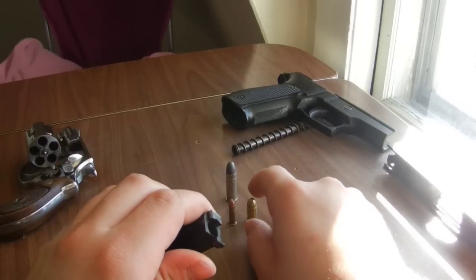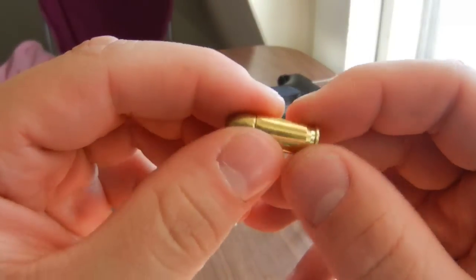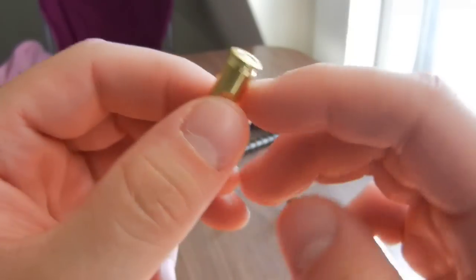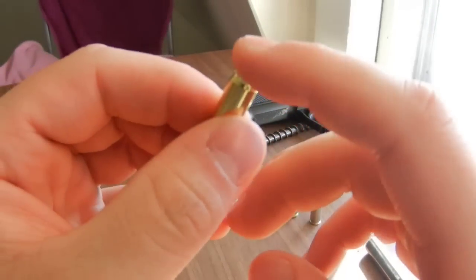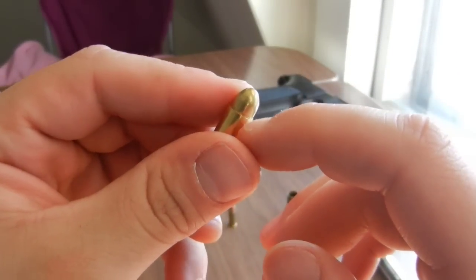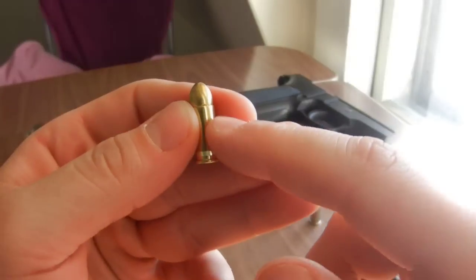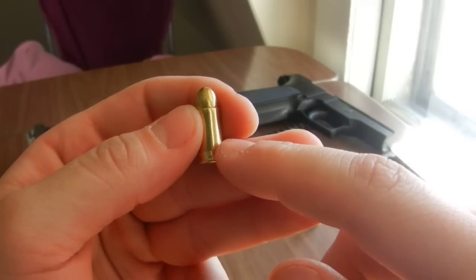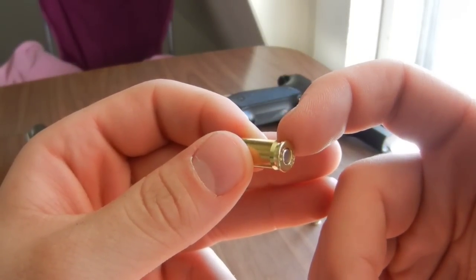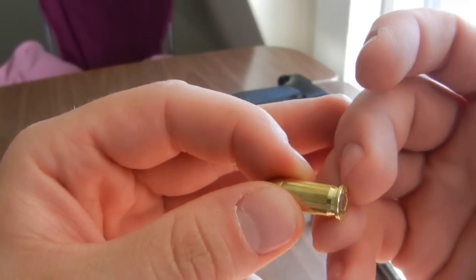You also have some that are like this one, like the .32 ACP. They're called semi-rimmed. This one has a very, very slight rim that protrudes just very slightly. The .38 Super is another one that is semi-rimmed. These also headspace off the case mouth. These are just like the 9mm cartridge except they have a semi-rim. The .38 Super, back when it first came out in the 1920s, headspaced off the semi-rim, and the original .38 Supers had a reputation for extremely poor accuracy sometimes — because the round headspaced off that semi-rim.